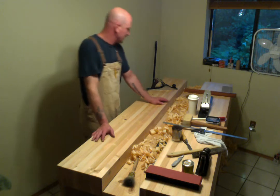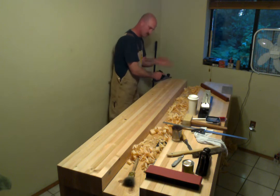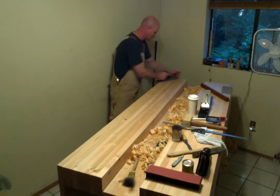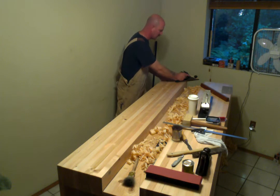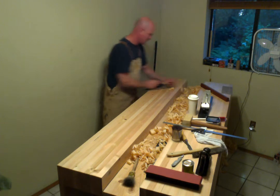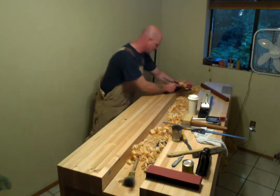Anyway, I'm going to go ahead and take this last pass and get on with the lengthwise cuts with the grain. Right now, all my passes are taking full-length shavings. So once I get a level flush with that one corner, I'll be ready. So don't forget to keep your pressure in the right spot as you do this step, or you'll be doing it for nothing.